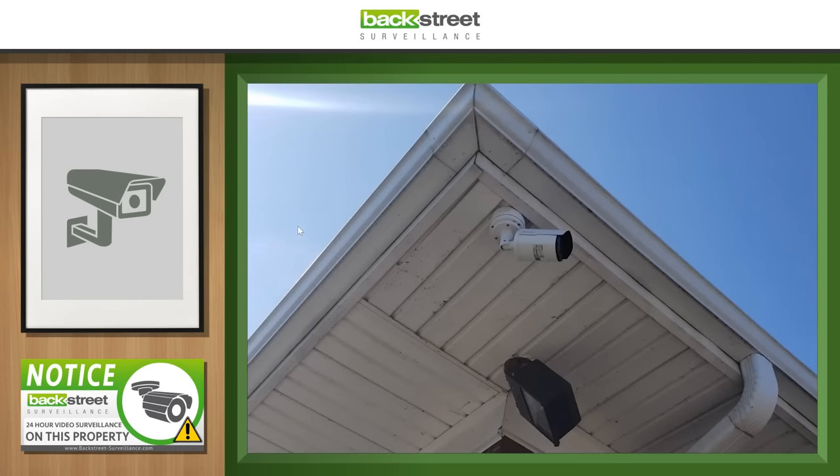Good clean install. They clearly worked with the attic on this — came in from the attic, drilled a hole that puts you up into the attic area. You send a fish tape or glow rod up so you don't have to get into the cramped corners of your attic, then just pull your cable down. They used a back box to mount the camera, which brings the camera down away from the soffit and siding lip — probably giving a better view. It's clean, done right. We give it an A.